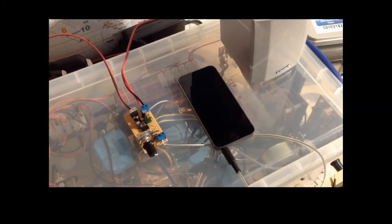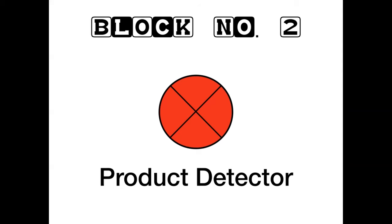So that is the audio stage. Right, and that's the beauty of those things. One thing I haven't got time to go into tonight, but is connected to all this stuff, is test equipment. And people often ask, what test equipment do I need to do this? When I joined the meeting tonight, I think people were talking about nano VNAs. I would definitely advise that you get a nano VNA, unless you happen to have a really good spectrum analyzer or something, which most of us don't. It's a great little tool, and we'll come on to that in a minute.